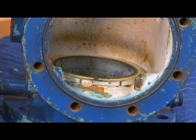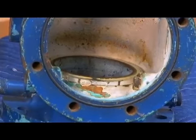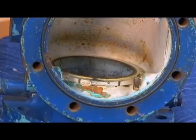So a lot of times when people go to surface this seat or polish it, they'll take sandpaper in there, which you never want to put on a seat, as we've said, and they start sanding it down and actually removing that very minor 5-degree taper. So make sure you know that that taper has to stay on the seat just like that.